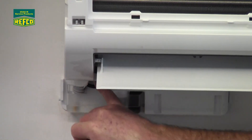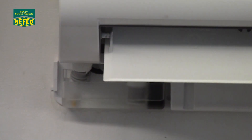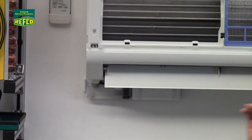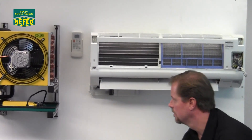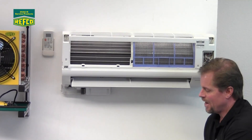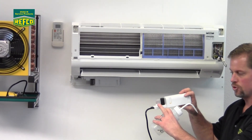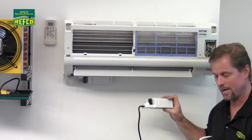On the water connection, you can use vinyl or you can use silicone, but either way make sure that you use a cable tie or a zip tie to secure that water line to the pump itself. There's a little bit of pressure on the outlet side — you don't want that line to come off. Another nice thing about these pumps is that they have an electronic sensor right here. This electronic sensor measures the level of the water and it drives the pump accordingly up and down. There are about 38 different speeds these pumps have.